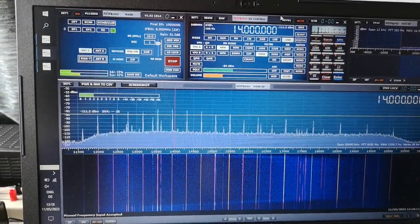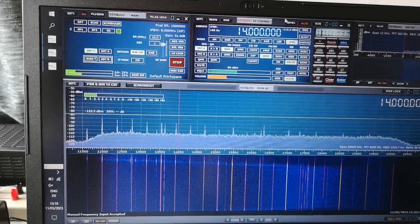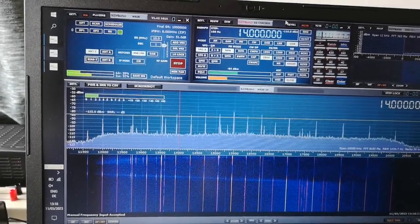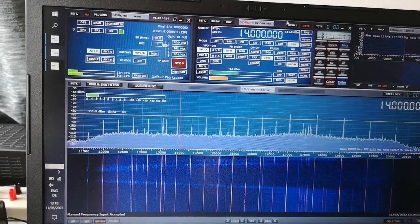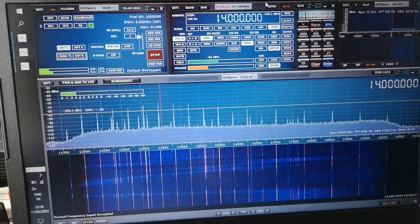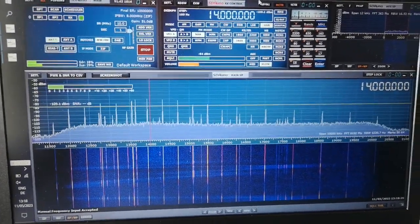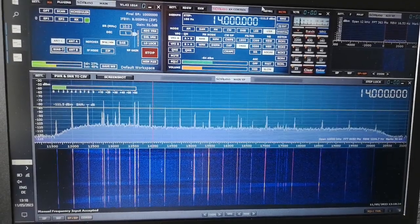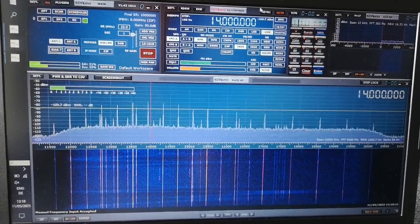But this primary tuning seems to go from below 10 megahertz because it's supposed to include 7 all the way up to 18 or so. So that's an easy way of tuning the receiver. You can listen to the noise, of course, audibly and adjust the antenna, which is what most people do. You can just look at the noise visually like this to tune the antenna.